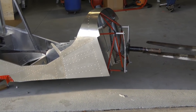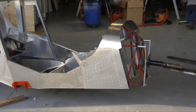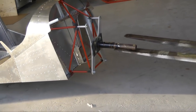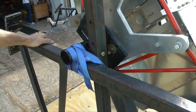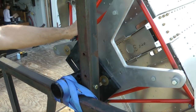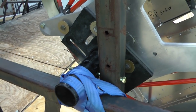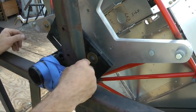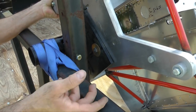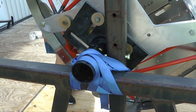While the front mount alone is not sufficient for most applications, in our case this Zenith fuselage had the strength to be lifted entirely at this one location. What we used in the front: we've got a metal scaffolding here that we just happened to have on this platform. We have an engine mount, or we could have used a temporary mount of some sort. Then we took one of our brackets from the engine stand that we bought from Harbor Freight, bolted that to the front of the airplane, used a pin through our steel fitting that we can pull and rotate and re-pin. That does every eighth-turn rotation so we can index it where we want it for painting.